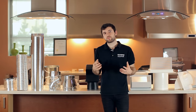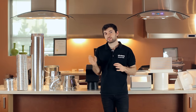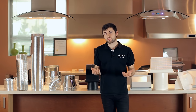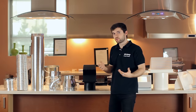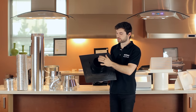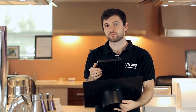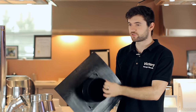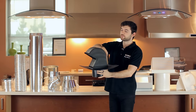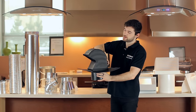The same is all true for a roof cap. If you need to put a roof cap on, make sure that the size is the same as the duct that you're using. The bigger the duct, the more efficient your hood will be and the quieter it will be. If you're using a roof cap like this one here, make sure the entrance and the exit are both the same size — for example, 6 inches on both sides. Also note that the roof cap gradually goes out; it's not a sharp angle, it's smooth.